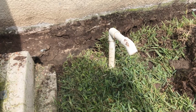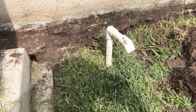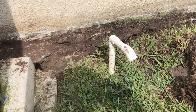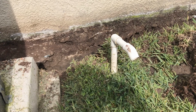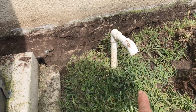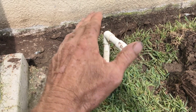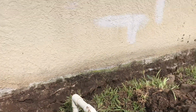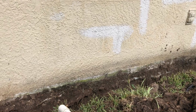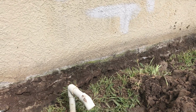Here in Florida, and everywhere in the country where it's humid, in Charlotte, through Virginia, it doesn't matter, if it's really humid, your AC is going to spit out hundreds, even thousands of gallons of water. And wow, make sure that this thing has a discharge. So what has happened is this water has backed up underneath the home, and he's got hardwood floors in here, and they've just all buckled. Everything buckled. Baseboards are wet every time it rains because there's no place for this water to go.